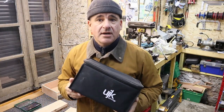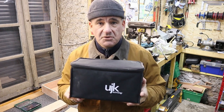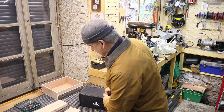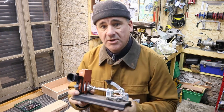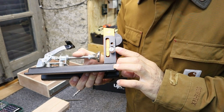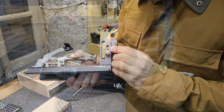For the next job, the pocket holes, I'm using the Axminster pocket hole jig. I did do a video on this quite a while ago now, but I'll put a link down in the description to that. But it is a great jig. I spent quite a bit of money on it, but I think it's worthwhile. So I'm just going to set this up. So the first setting I need to do is change the wood depth, the thickness. So I need to move it between 18 to 24, which is the next one up.